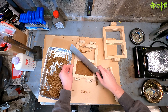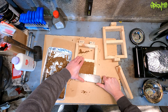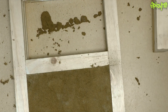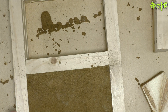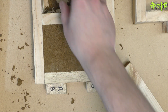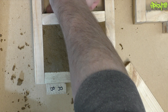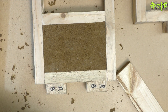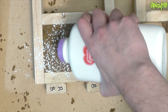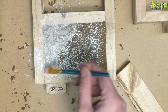I'm really concerned as to how hard this sand clay is — this is supposed to be for fine detail. I need to use talcum powder as a parting agent. Talcum powder is not the best thing, and there are better options, but this is just a test run. The talcum powder is going to stop the other half of the mold sticking to this side so we can separate it.